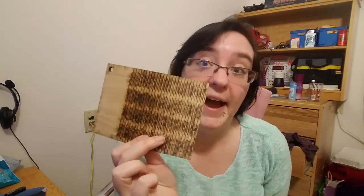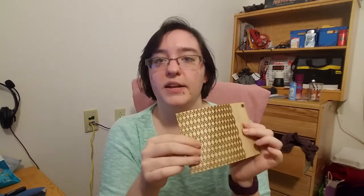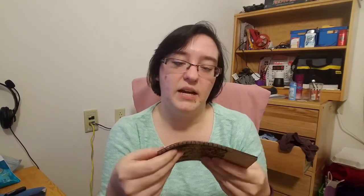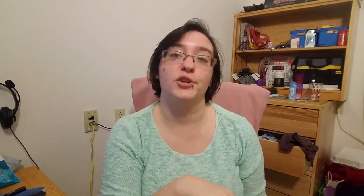I had my laser cutter a little bit too hot, which might be the downfall of the other two. The cross came out okay — you do get a little bit of flex, and it's more of a diagonal flex rather than a straight flex. It does have a couple of breaks in it, and again that might just be due to the heat applied. I used a preset and didn't test beforehand — don't do that. It's hypocritical of me to say, but always test your cuts beforehand just to make sure this doesn't happen.